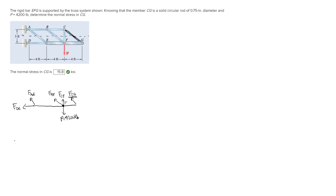If we take the moment about point F, that's going to cancel out this force, this force, this force, and this force, because the line of action of all four of these forces goes directly through point F. So the horizontal distance when doing the sum of moments about point F is going to be zero for all these forces, leaving us with just two forces to work with — which is a lot better than six. As of right now we have two unknown forces, so we cannot do sum of forces about point F quite yet.